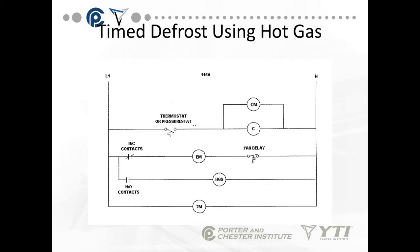The hot gas defrost circuit is similar to the electric defrost circuit, except the compressor and condenser fan motor remain running during the defrost cycle. All we do is shut off the evaporator fan and enable a hot gas solenoid that bypasses discharge gas from the compressor directly to the evaporator. In summary, there are three types of commercial defrost: off-cycle, electric, and hot gas. Off-cycle is the only one where evaporator fans remain running, and it is only used in medium temperature refrigeration where the box temperature is above freezing. Once the box temperature drops below freezing, you must use electric or hot gas defrost.